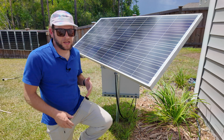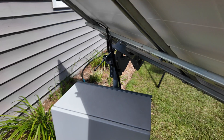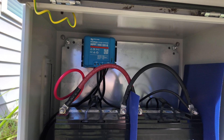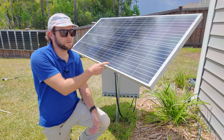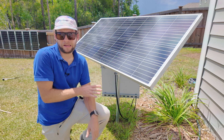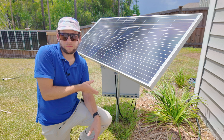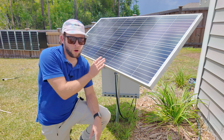What I've done here is put in a 180-watt solar panel on a mount essentially for a satellite dish. It has an outdoor-rated enclosure below that contains my batteries and a solar charge controller — that's essentially it, other than fuses. Batteries, controller, and solar panel. This solar panel produces way more power than I need and is regulated down by the charge controller. Even on super overcast rainy days I can pretty much fill my batteries as much as I'd ever need, and I'm running north of probably 20 landscape lights around the property all off this one system.